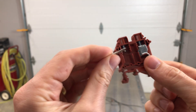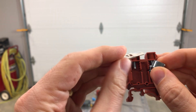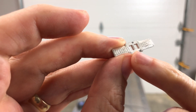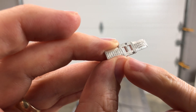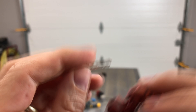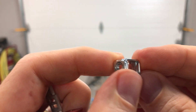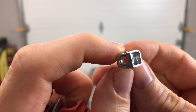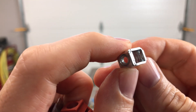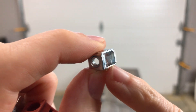I disassembled one of these connectors so you can see how it's able to grip those wires so tightly. The top plate has little grooves in it that embed in the copper wire and just crush it, allowing it to grip incredibly tight. The bottom-side connector also has little grooves that compress from the other side as the screw tightens. Together, the force of the screw crushing the bottom and top surface together and smashing the copper wire with those grooves is how it holds on so incredibly tight.